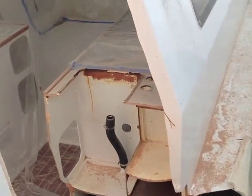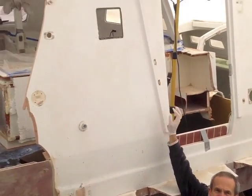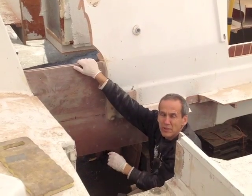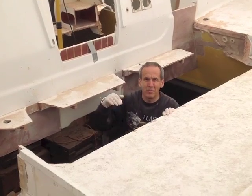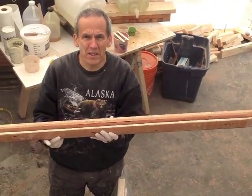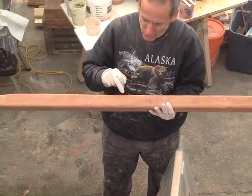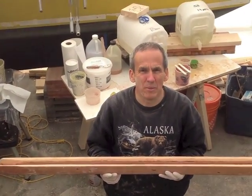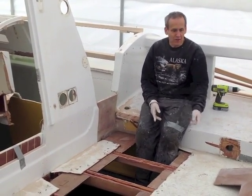Week 13. As you saw last week, we cut off the back of the cuddy cabin — much to Carly's chagrin — but we've now attached it with big bulkheads to the rest of the hull, giving us three feet extra in there and two feet extra in the cockpit. To prevent people falling through the cockpit into the water, we're filling it in with pieces; the beams go underneath. They're made out of one-by-two and one-by-three fir wrapped in glass cloth — a little U-beam.